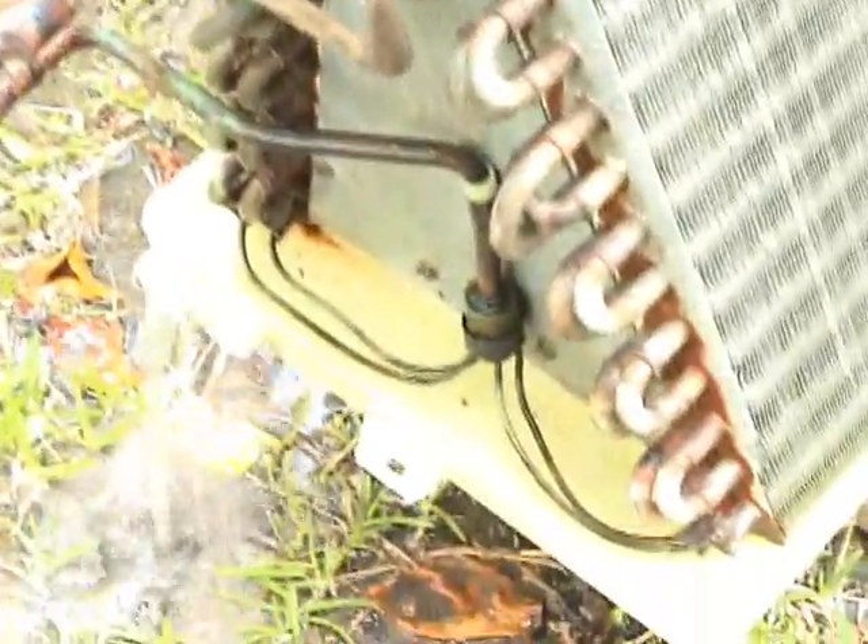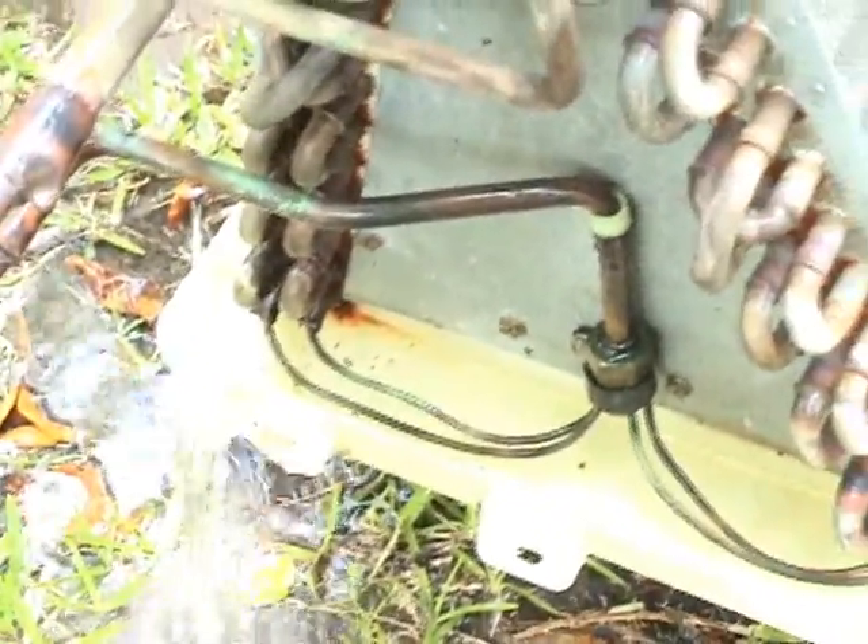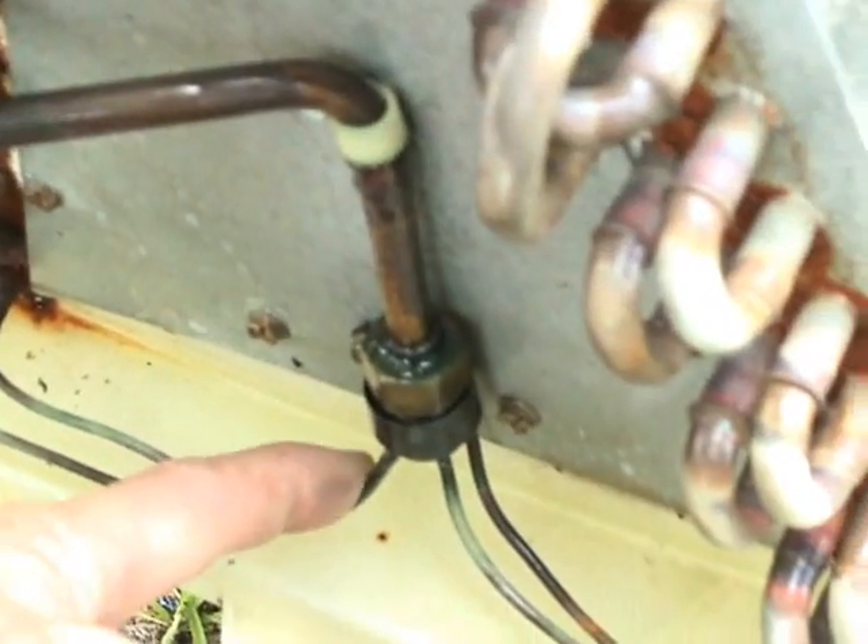While you're cleaning your coils, you can always make sure that there aren't any problems you could run into later on, like your capillaries here — they could rub or something like that, so you want to make sure they're not touching anything, otherwise it could develop a leak. Also right here on your tubing, this part here we need to adjust because this could turn into a leak one of these days.